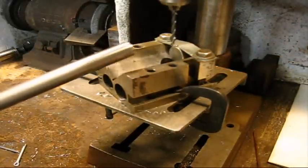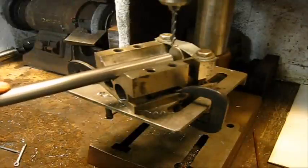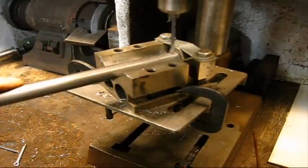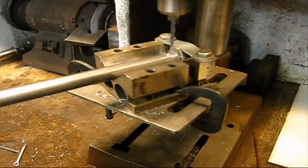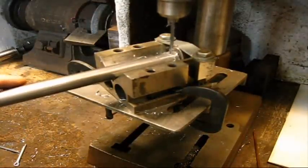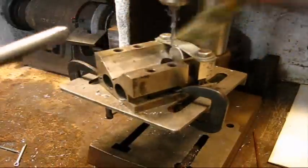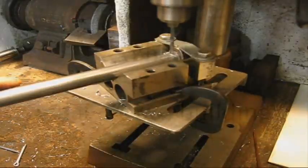This is just fast and gets it done. And each individual one is one of a kind. This is not a CNC operation. So, you know, just a good drill bit is required or it will wander. You'll be all over the piece of the round stock if you do not have a very, very good drill bit. Clean the chips off about three times. I have found that out on this stringy type 1018.